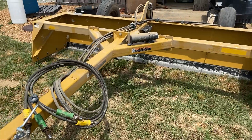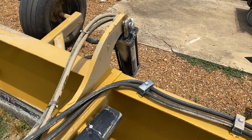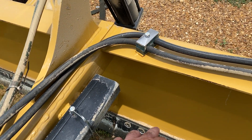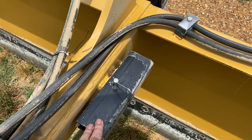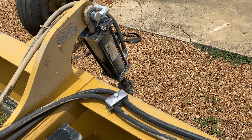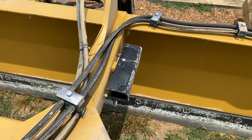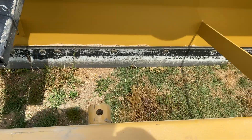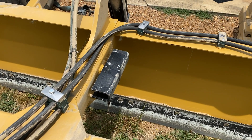What we've got to do is mount two brackets or plates — like a quarter moon plate will come in here and go over to here on both sides. We're going to have to relocate this bar right here to put it around that rear cylinder, so if your hydraulic line broke, you wouldn't tear everything up. We're going to take that off, cut this mount off, and relocate it over here somewhere, and get everything ready.